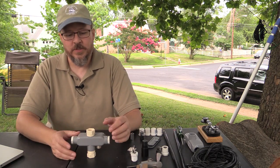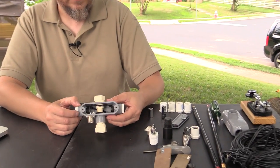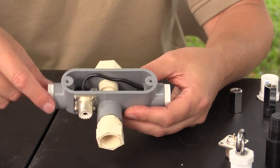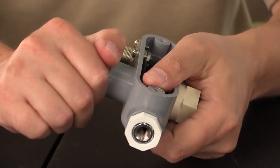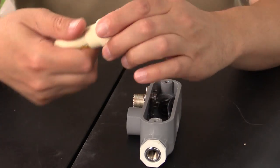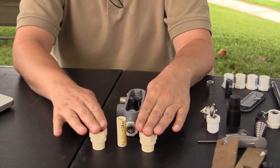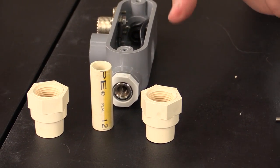All these features really make this a nice little platform - I think of it more as a platform rather than an antenna. Let's take a look a little bit on the inside. You can see it's a very simple design - it's just an SO239 soldered onto each of the ends here. In this particular one, I have it so that you can actually take it apart. This here is the mount part, and this is using CPVC pipe. This is where we're going to start a little bit on where you're going to run into the challenges.